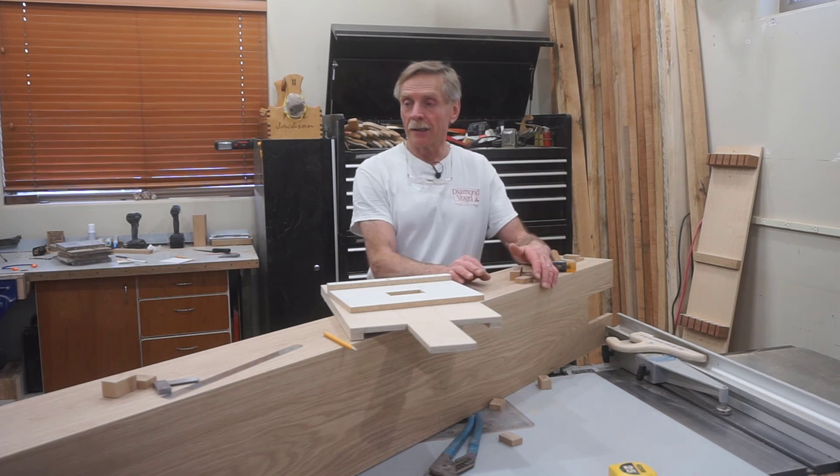Next I'll put the template back precisely in the same place I had it when I marked for the cutout, use a plastic mallet to tap it where I want it for flush trimming with the router, then clamp it in place so it doesn't move. You can see that the shoulder of the template is lined up precisely with the side of the beam leaving a strong sixteenth of an inch to flush trim with the router. The rough tenon is just a little bit long so the end will get trimmed off, and there's a slight misalignment from one side to the other in the glue-up, so I'll trim the shoulder of the tenon in a separate operation to get everything square and true.